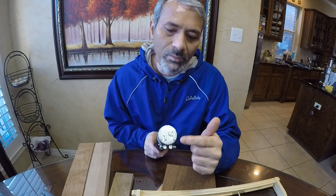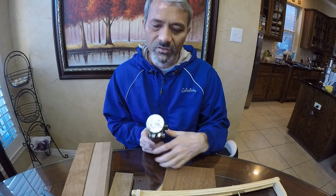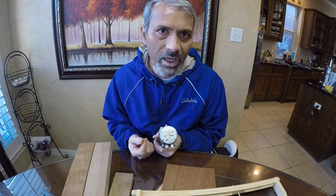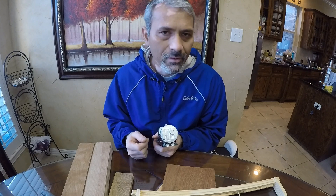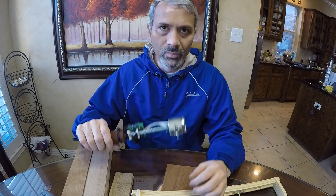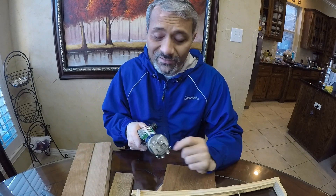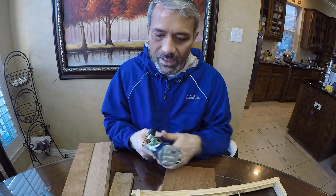So this has to be a mirror image. As you can see here it says H9, but it's actually going to print PH — it's a mirror. If you have a 3D printer, you can create a positive mold of your brand and then turn it into some sort of casting. There are many different ways to make this block, but the important point in this video is how you can make it electrically operated, because those seem to be very expensive. This gives you a cheap option to create an electrically heated branding iron.